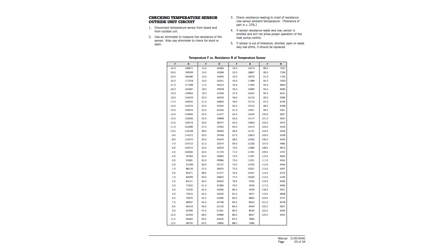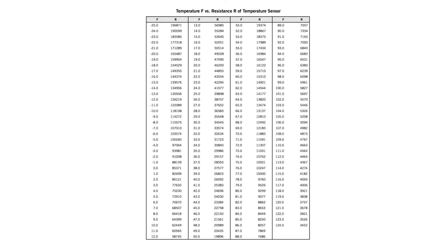If you're having a problem with a defrost sequence, you need to look at the sensor. You can ohm that out — it's a 10K ohm at 77 degrees. There's a chart in the installation manual that outlines for specific temperatures what that resistance should be.